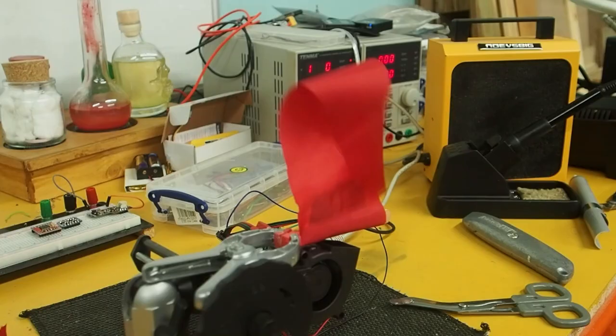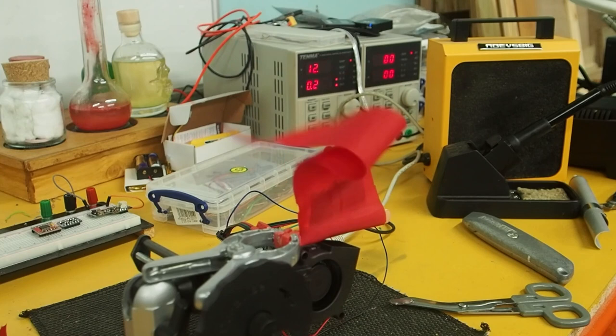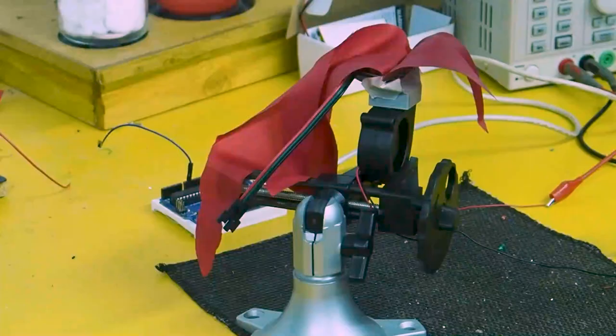I also prototyped different positions of LEDs and discovered that the backlit LEDs work the best. I used a little NeoPixel LED and experimented with different colours. And then I needed to prototype the code with just a couple of small components and an Arduino Uno, so that if I made any errors or blew anything up, it didn't have any side effects on my slightly more expensive Arduino Nano boards.